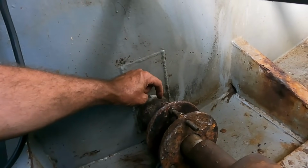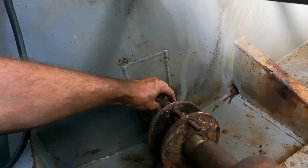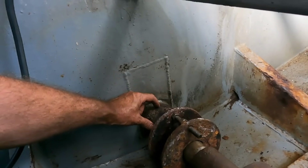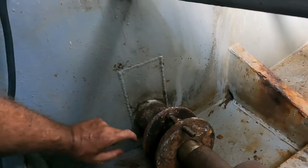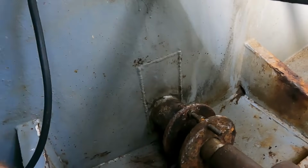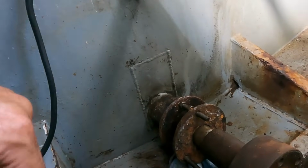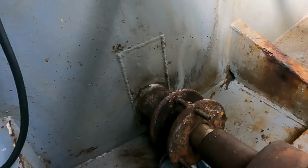Then I'm going to bring some drill bits tomorrow. Probably drill one hole here and try and put some penetrating oil in. And then another one here that's going to be for a grease nipple. Another option is just to put a cut through it. I mean, we could actually cut a sort of a sector out. But my big worry then is we don't repair it in time to go back in the water. So I think we're going to have to look at a second booking somewhere one day just to tackle this.